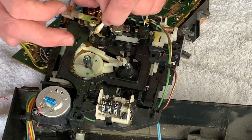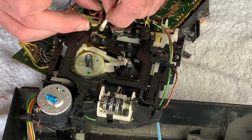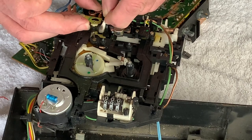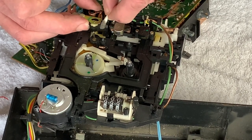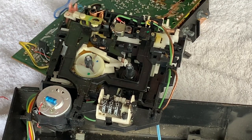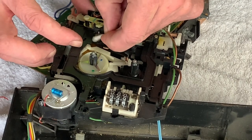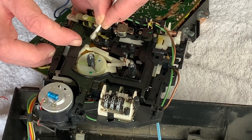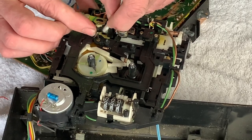Playback head's okay now. And we'll just get this pinch roller clean. Yeah, it was due a service I think - pretty grimy that. We'll just do the capstan while I'm thinking about it, get that squeaky clean, and just get some more off of here. Yeah, it needed doing didn't it. Right, I'll carry on sorting this and then we'll start putting it back together I think.